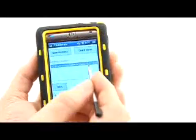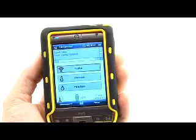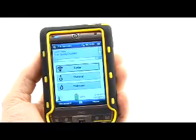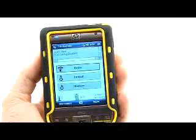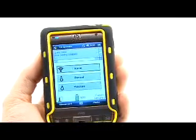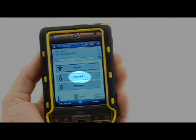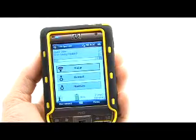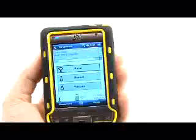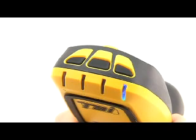To start the T3i sensors, select the Quick View button. This mode of operation will allow the three sensor modes to be operational, but will not allow the recording of any activity discovered. In quick view mode, select either the radar, thermal, or moisture buttons on the PDA to activate and operate a sensor. Alternatively, this can be done by using the mode button on the T3i device.